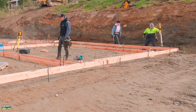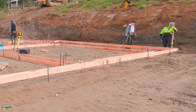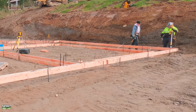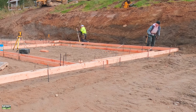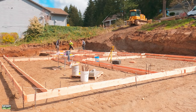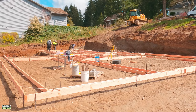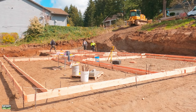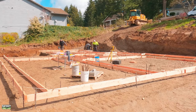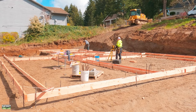You could hear us sloshing around in the water over there — we just didn't have time to have the excavators dig a small trench and drain it, and then we kept getting rain and sun, rain and sun. You can hear the wind on the microphone — it's been a pretty tough spring. Here's the process: I'm working the outside with Noah using 20-foot 2x6 floating boards, going end to end, then checking the middle, all the way around the outside. As you raise things you can sometimes sense that something else moved, so always double-check — we're going to pour concrete, we have to get it correct.